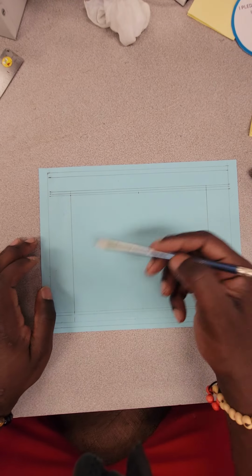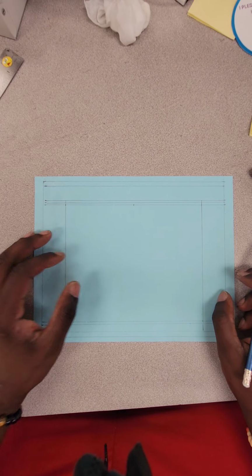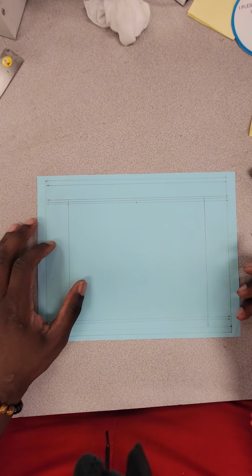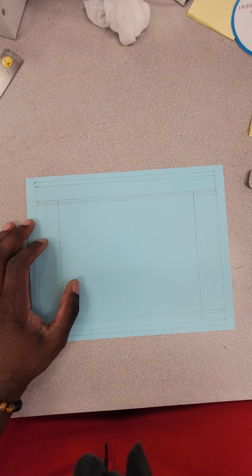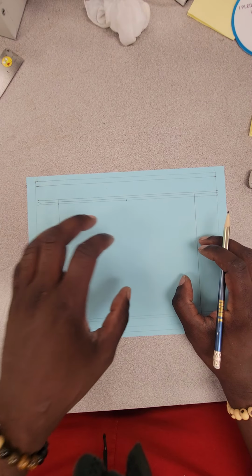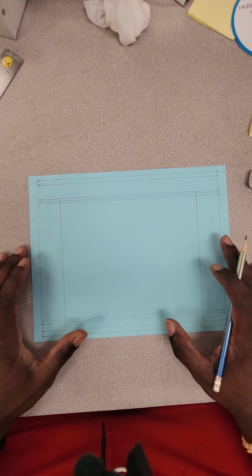All right, before we get into that, we're gonna fall back and put the studs in. So again, layout is gonna be 3/4 inch, 16 on center. Nothing changed there. We're also gonna put in our corner posts on here as well. So I'll stick that in as well. A lot of things will be happening, fire blocks going here as well. And we're gonna have another video just laying out, putting all of the dimensions and labeling and everything else. So it'll be a subtle part of the videos.